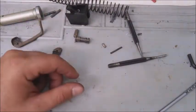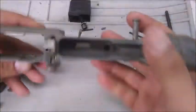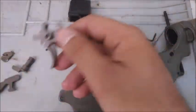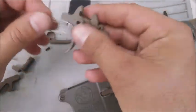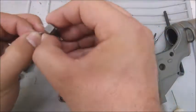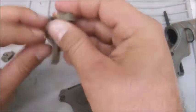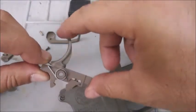That's how we take it apart. We've cleaned it up and everything is nice and clean now, dried out and ready to go. Starting reassembly of the lower: the reduced power spring goes on just like this — slip it up and pry these little wings over the trigger. It should sit just like that on the floor of the lower with spring pressure.